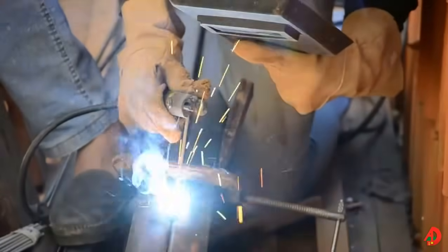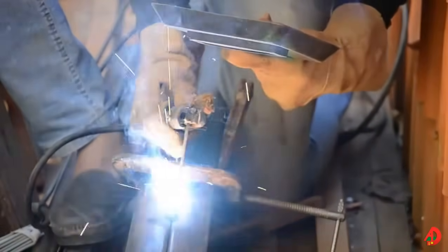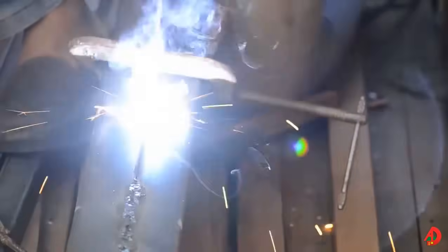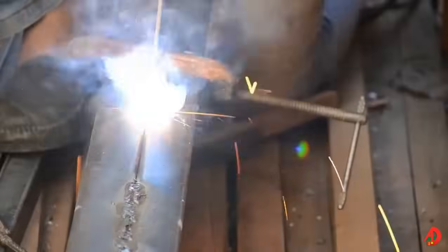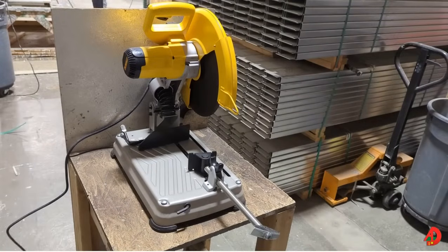Most often, welding is used for prefabricated wall sections. When welding light gauge steel components, the zinc coating applied during the galvanization process will be destroyed in the welding area. A corrosion resistant coating must be applied to the area.